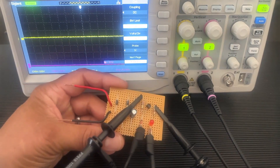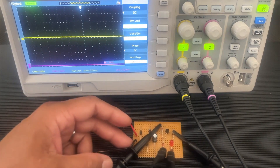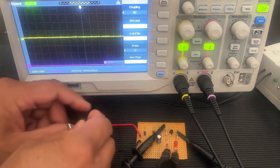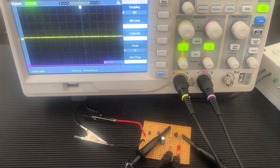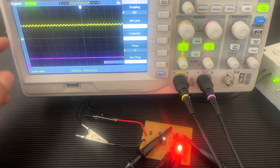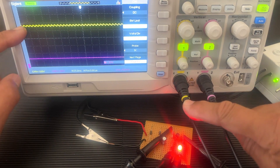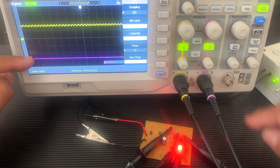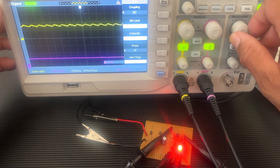This is for very sensitive and detailed readings. The oscilloscope is actually more accurate than a multimeter, but that's not today's lesson. I again want to put the power supply onto this circuit — the same power supply I used for the multimeter testing. I just plug it onto the leads, and with the oscilloscope already on I press the auto button. In this case it came on on its own and I've got a wave that looks like a DC wave. The yellow is output A and the purple is output B. Let's zoom into this wave.